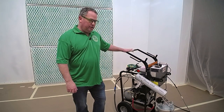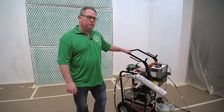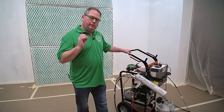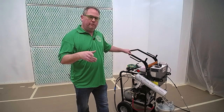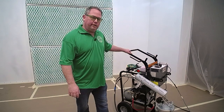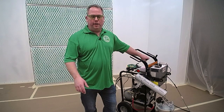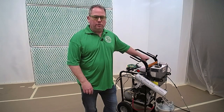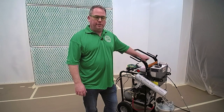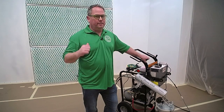It is a self-contained painting apparatus. I use the word apparatus because it doesn't actually spray. It uses a handheld bell that electrostatically charges the paint and essentially flings it off, and it's attracted to the grounded workpiece by electrostatic charge. It's probably most popular in things like painting school lockers — very minimal overspray — and hand railings. And today we're actually going to use it to paint the exterior of our brand new spray booth, because I wanted it green.